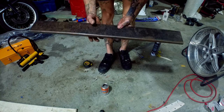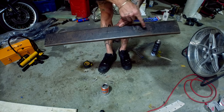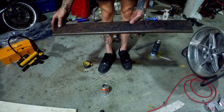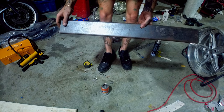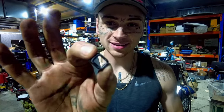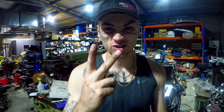Every three and a half inches from center - one, two, three, four, five, six, seven, eight, nine. I'll drill these out on the drill press, center punch them, and then slowly start dimpling them out. Also, I can tell you right now with absolute certainty this wide angle lens I'm about to put back on is going to be broken probably within the next two days - it just magnetizes on, gets metal filings on it, and keeps flying off.